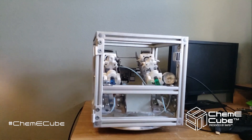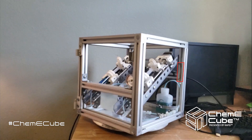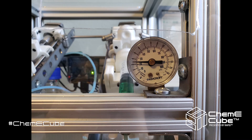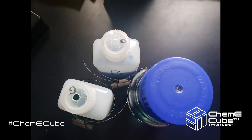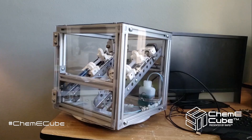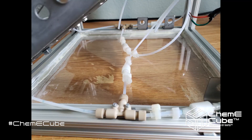Some notable safety elements include safer design by incorporating electronics above the pumping fluid, incorporating the electronics wires into the extruded aluminum frame, the inclusion of a pressure gauge, calculations of pressure drop in straight and curved portions of the micromixer using the Darcy-Weisbach equation and the Moody friction factor to show a pressure drop of less than 1 psi, an open air design in the liquid containment vessels to prevent pressure buildup, and secondary containment in the cube's removable acrylic side and top panels as well as a watertight bottom panel.